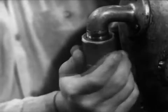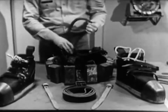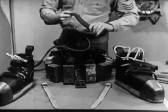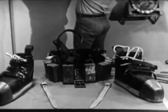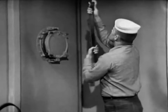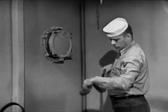Next, carefully examine the belt, shoulder strap, and jock strap. Look for tears, nicks, worn areas, or elongated buckle holes. Treat these items occasionally with a coating of Neatsfoot oil, well rubbed in. In addition, the tensile strength of these leather items should be periodically checked. A buckle is secured to the overhead and the item to be tested is run through the buckle. If the belt, shoulder straps, or jock strap can support the weight of a man weighing 160 pounds, its condition is satisfactory.